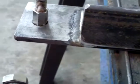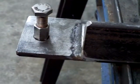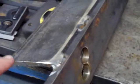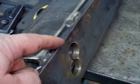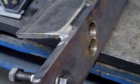The only thing left to do is tack those at low amp, low feed — they just need to hold about a thousand pounds, which is not a big deal. The surface of this part where the bolt goes in is three-sixteenths of an inch higher than the edge, and where the other part goes on, it's flush. That is to prevent interference with the other parts that act upon this.